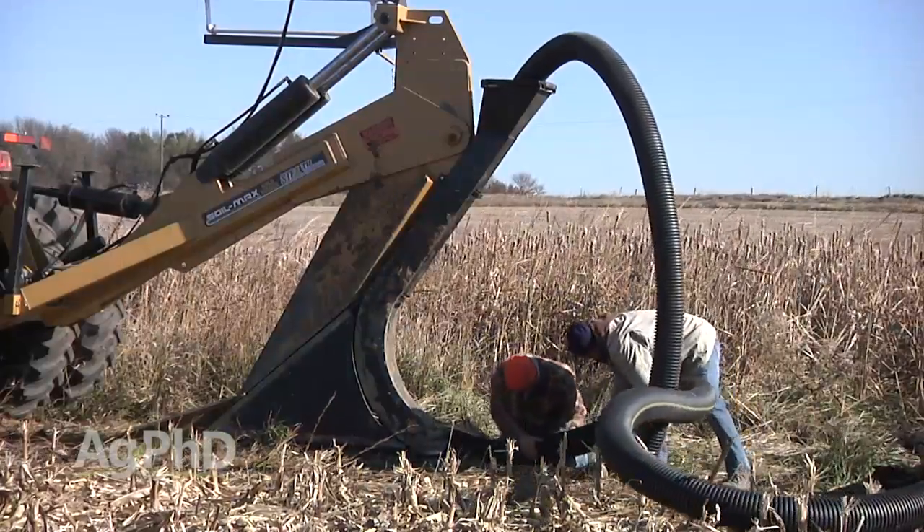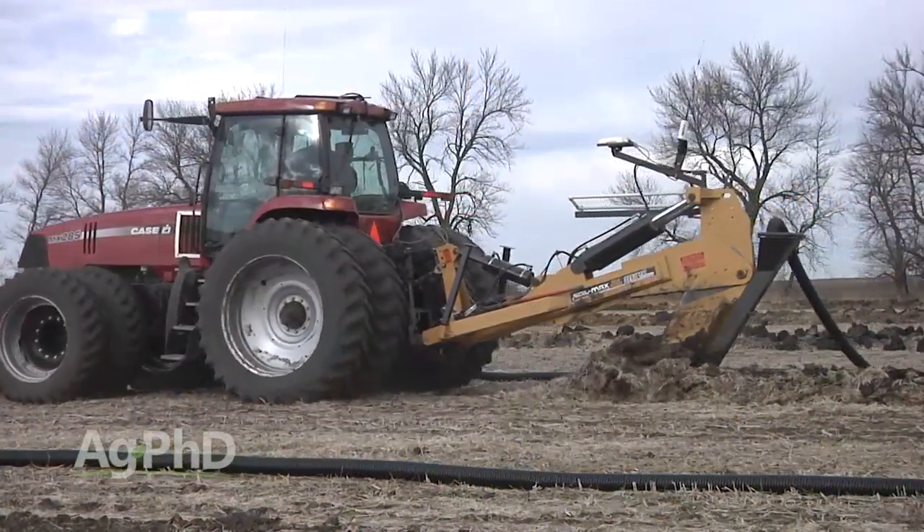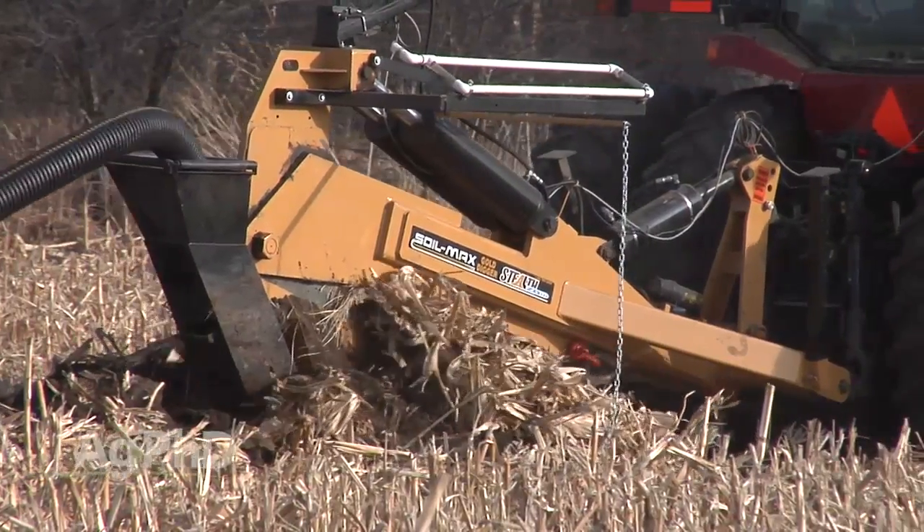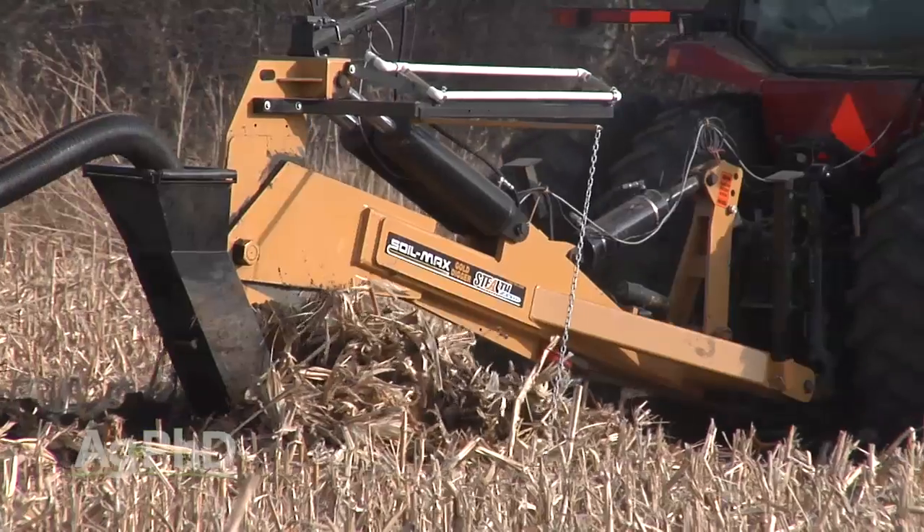It's the same thing around your house — it's the reason why you want to have that drain tile a foot or two below the foundation, because if you have it above part of the foundation, the water table could rise all the way up to that level and seep into your house. So out in the field we've got to make sure that we have these tile lines below the root zone, and the root zone for most crops is about three feet, so we like to have the tile lines at least at a three-foot depth.